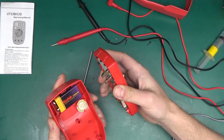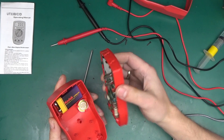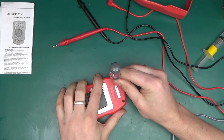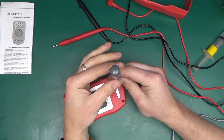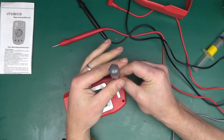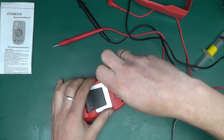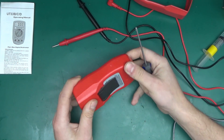That wide lip really is nice for preventing any explosion coming out and containing anything that goes wrong. The screws are self-tapping, so be gentle with them. A tip: when reinserting self-tapping screws, turn backwards until you feel the screw grab the old thread, then screw forward into the same thread as before. If you force it in straight, it will cut a new thread over the existing one and that considerably shortens the lifespan of the hole.